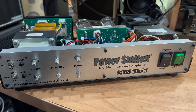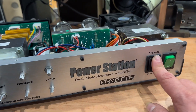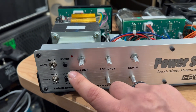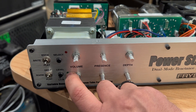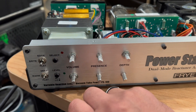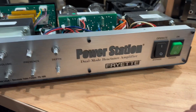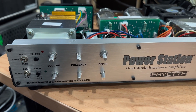I turned it off and powered it back on because I had a weird feeling something had happened. It powered on, but it would not come out of bypass. I would flip the operate switch and no change. Also, hitting the select switch — it was stuck on the warm channel, on the green. I would hit it and no change. It would still work in what they call line-in mode, so it would work passively, it just would not attenuate.